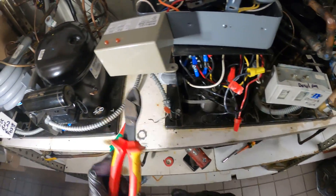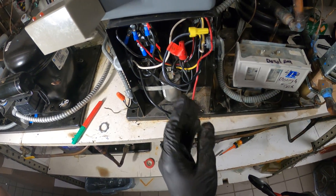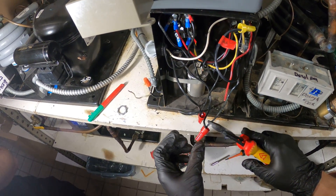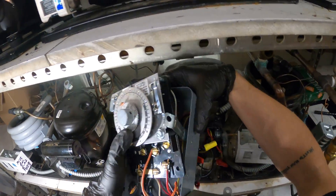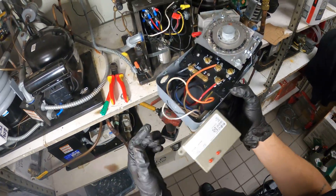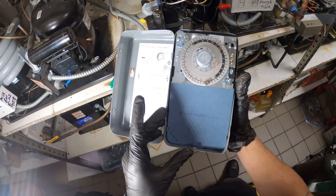Now that relay wire is out, and the two power wires are 208V. I'll leave one marked so I can see the red goes here and the black wire goes here. So then I know this one goes here. We still have to disconnect the line and quite a few things — three terminals here — and rebuild everything. This thing is crazy. Here's our new clock — let's go ahead and see exactly what's going on.